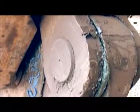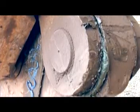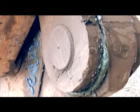That's exactly right. You have metal on metal contact, and even worse, once that grease is gone, there's no seal on the outside really to keep that water and contaminant ingress from occurring and causing extensive wear. But tell me about the seal. What are you talking about when you're talking about a seal when it comes to grease? When you grease the piece of equipment, it both lubricates and pushes out to the outside of the component so that it creates a seal, keeping that water and contaminant ingress away.